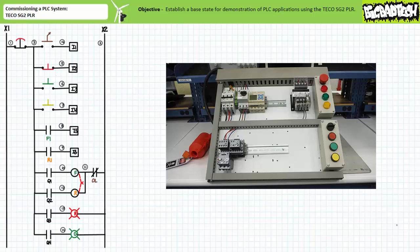The four field input devices go in the bottom push button enclosure as indicated in the schematic. Top to bottom, they are the normally open maintained contact selector switch, the normally closed momentary contact red push button, the normally open momentary contact green push button, and finally the normally open momentary contact yellow push button.